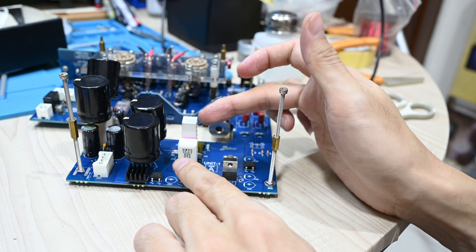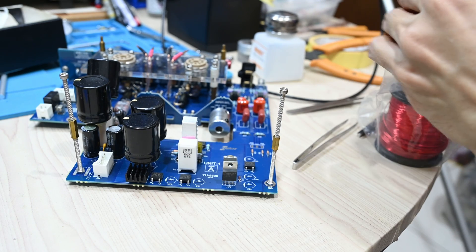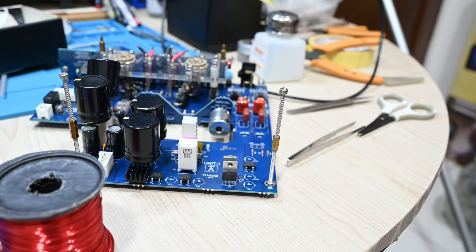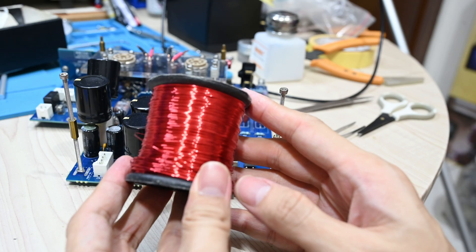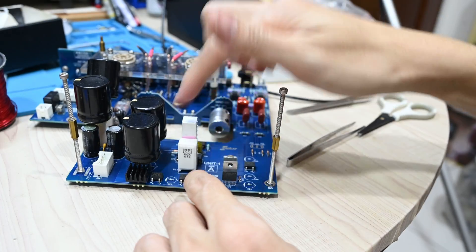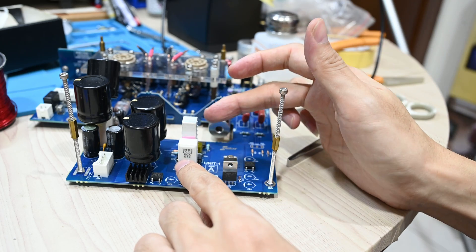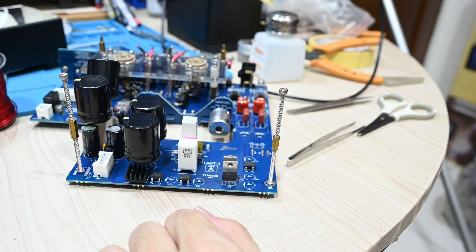I think this won't be too sticky on its own, so I plan to use my copper wire to attach the heat sink more securely. This is my very thin copper wire, and I will circle it around the heat sink to make sure it attaches both together, keeping it tight so it will not suddenly drop. Let's continue.